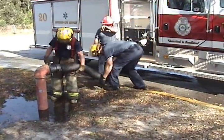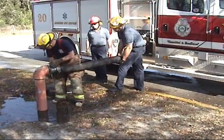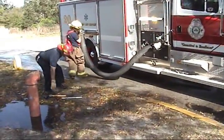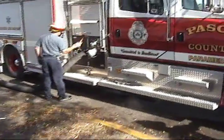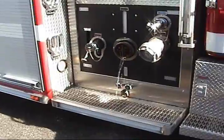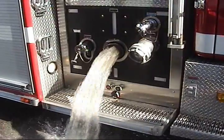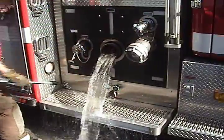The hose will still be heavy with water, so you might have someone give you a hand. Break it all down and bleed it all down. Once you've disconnected the hose from the hydrant, disconnect the hose from the truck — everything in reverse order. After completely disconnecting the hose from the truck, drain the water out of the hose, and the pump will begin to drain. If you still have water left in your tank, you might do a street flush, but remember you'll need to get to a hydrant and completely flush all discharges and inlets.